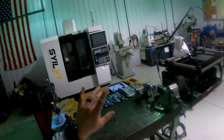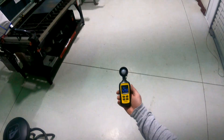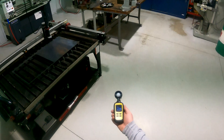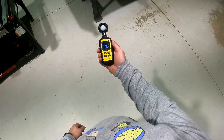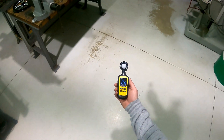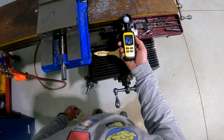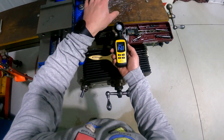Now I've got the light meter out. The other old light is turned off, but underneath this LED you can see I'm at 1,230 to 1,250 lux. In the middle between the two LEDs — before I had just over 500 here — now we're at almost 1,300. So that's about two and a half times brighter than before. Going over to the Bridgeport, where before we were at 300 lux, now we're at 850 — over twice as bright in that work area.